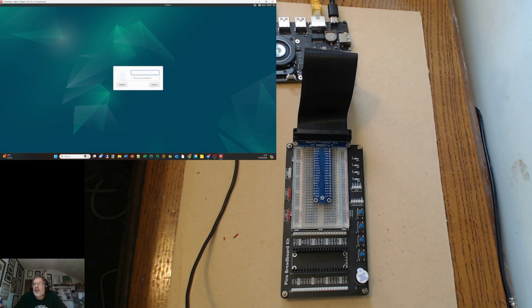I think if you actually optimized it so it wasn't going through startup menus and things like that, which I think the booting is an optional thing, you can get that down to sort of 15-20 seconds, quite nice, and that's pretty snappy. If you compare it with instruments out in the wide world like an oscilloscope, they take easily that amount of time to boot up. So you can build quite a nice, fast embedded system here that works very nice indeed.